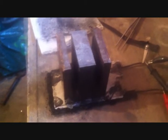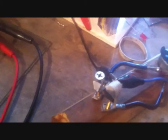Well, back. It's now the next day of this cell, and this, I have to admit, is one of the strangest cells I've seen. Yesterday I was playing with the charge and charging it up and down. I've got a tail rotor from one of the micro choppers as the load for this cell, and it will run that with a charge. A 10 second charge runs that motor for 2 minutes. A 1 minute charge runs that motor for only 20 seconds, which is strange.